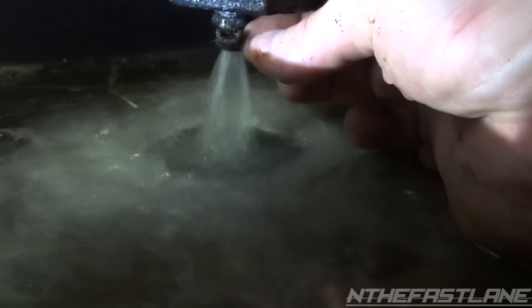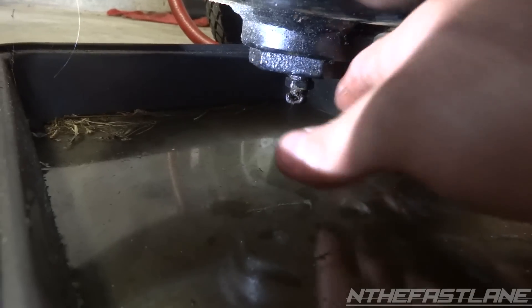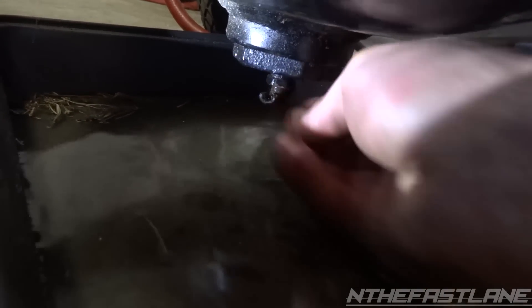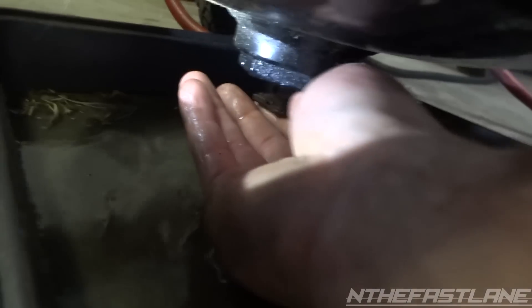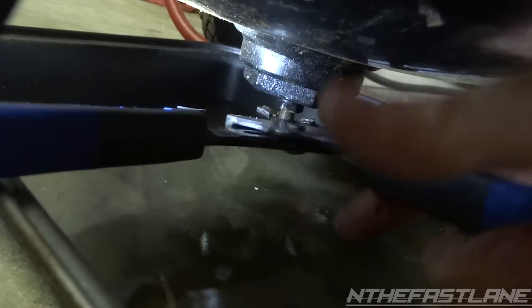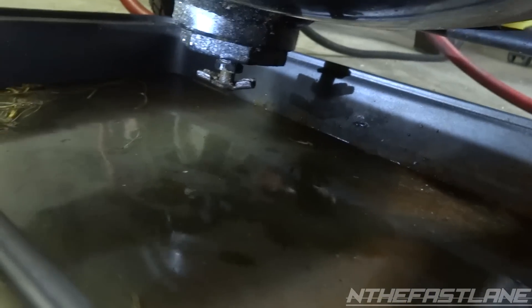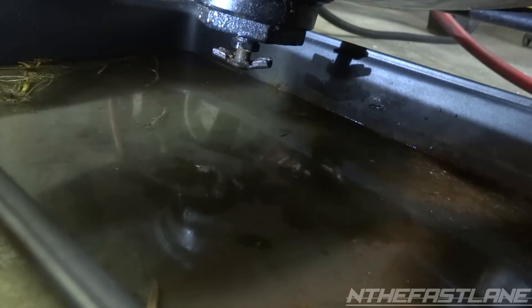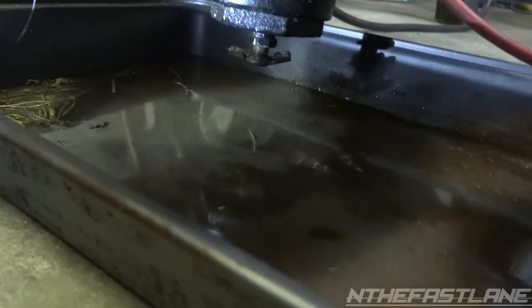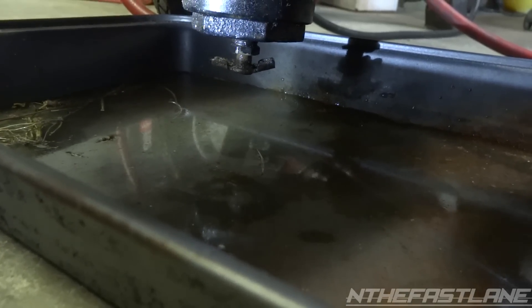You'll get quite a bit in here. When it's all done draining, you're just going to righty-tighty — it'll look like it's coming down but that's okay, that's what it's supposed to do to seal up in the tank. Give it a nice little tighten, then finish it off with the crescent wrench to get it a little extra tight so you don't lose any compressed air. Then you're pretty much good to go — go ahead and turn the switch on and fill it up.